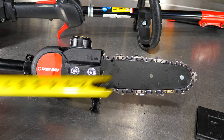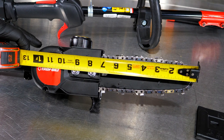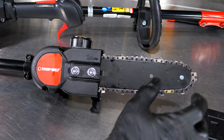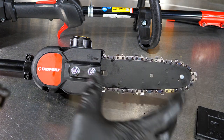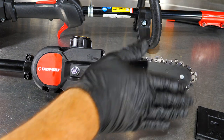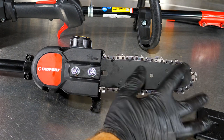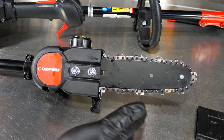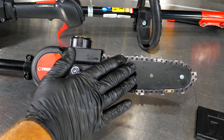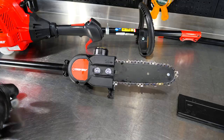This is an 8-inch bar and chain, so as far as the cutting area, you get about 7 inches to use for cutting. Be careful, because when you're cutting on the top side here — anywhere near the tip — that's kind of your kickback zone. In other words, if you try to cut something underneath and you get it near the tip, it's going to try to kick that out. That's not as detrimental as when you're holding a small saw in your hand, but still, you don't want this overhead kicking back and throwing you off balance.